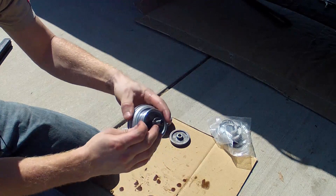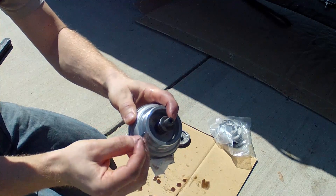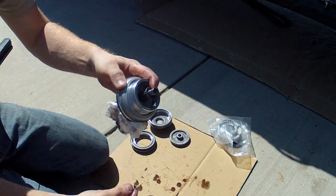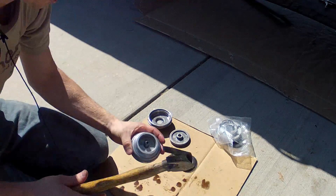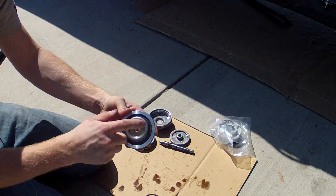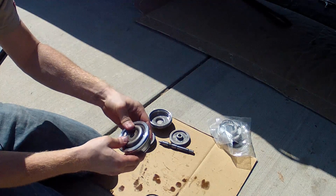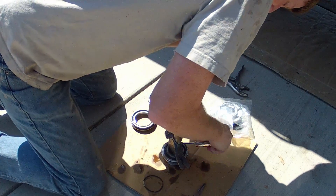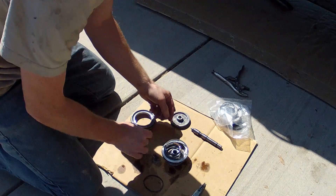I got this snap ring off for the spring. There's a little groove that this just slides into that holds everything on. I barely held this down with my finger and then got a screwdriver and pulled it out — it came out pretty easy. Then that spring comes off and you need to pull the shaft out. I'll try tapping it with a hammer. Now we need to get this cover off — there's another snap ring right here. If you have a big C-clamp or something, that would probably work.